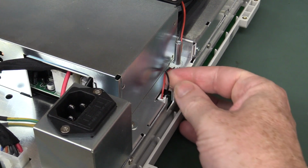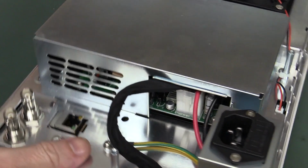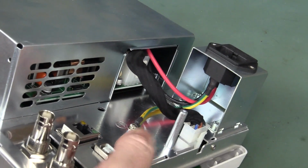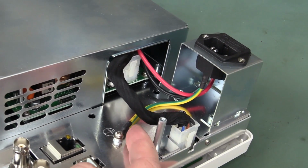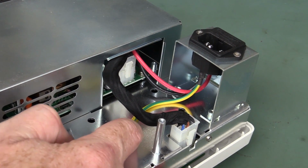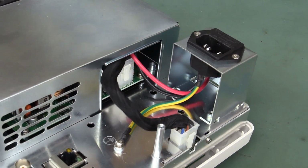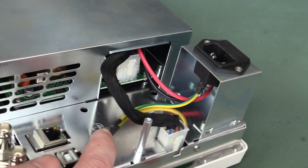But hey, there's a bit of attention to detail. They've cable tied down the cable for the fan there, and I like the mains input up on its own bracket there, heat shrunk properly, proper mains earth down here. That one, is that crimped or soldered? Anyway, it's heat shrunk over there. It has a shake-proof washer on it, very nice.